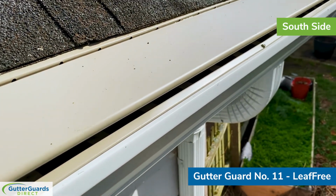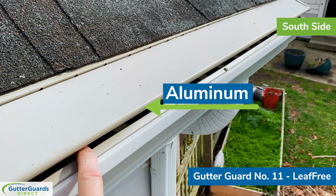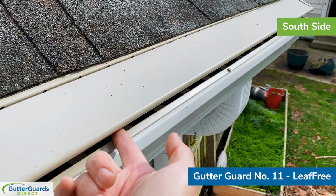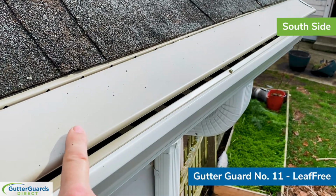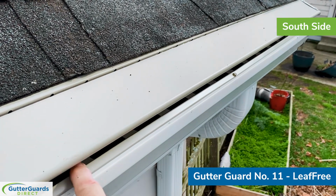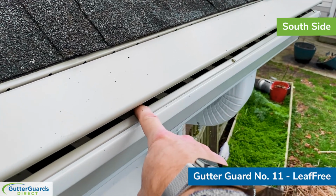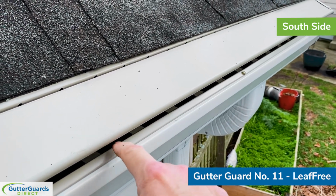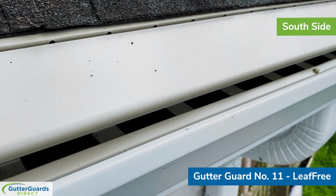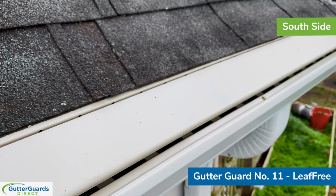And because this is a single piece of aluminum that gets roll formed out, this front area here is actually affixed to the main portion of the gutter guard, the main panel, and a series of attachments. So there are a bunch of slots through here that allow the water to go through, and then every few inches or so, 3 inches maybe, there's a piece of metal that kind of creates the connector. So if you see there, you can see those connectors.